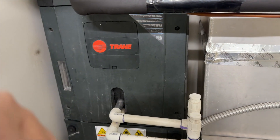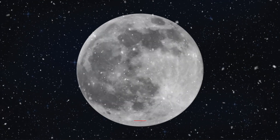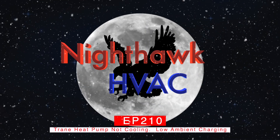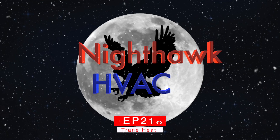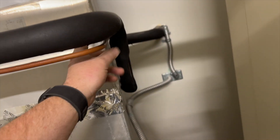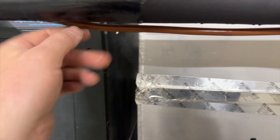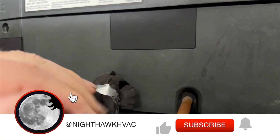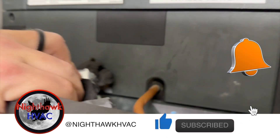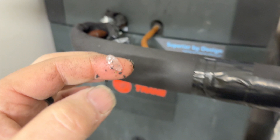I checked the supplies — it's definitely not cooling. The first thing I noticed is the liquid line is condensating. It's pretty wet. The suction line feels kind of — there's a little piece of ice in there. So we've got a little bit of ice. She's freezing over.